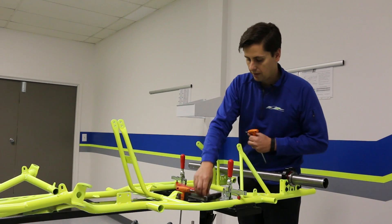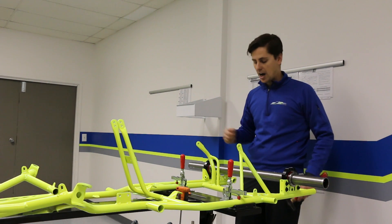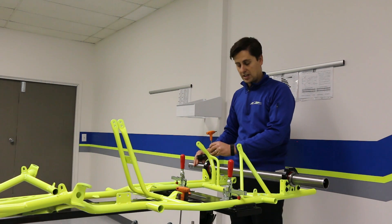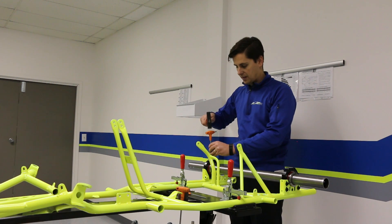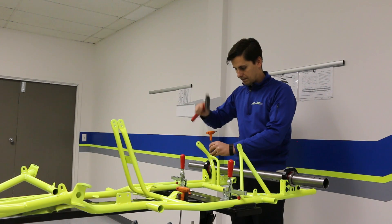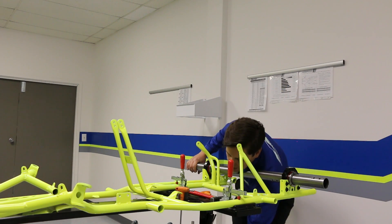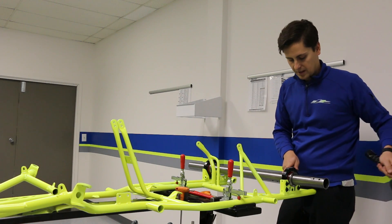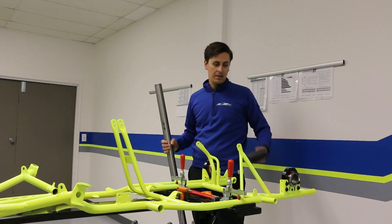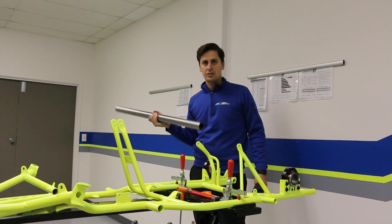Once the locking collar is loose and spinning around, we need to get the inner locking collet to actually release. In order to release that, we need to give it a little bit of a shock. Grab a T-handle, something with a blunt end preferably made of steel. Come in here on the bearing race and give it a pretty good tap with a steel hammer on three sides of the bearing. Once we've done that, we've essentially given it a little shock on the collet so the axle should just slide out easily. Grab a rubber mallet, give the axle a tap — just like that, the axle comes out. Great thing about this process: there's no filing, no deburring, no honing out bearings. You're ready to go — perfect axle, no set screws. Now you're ready to change to the next axle.